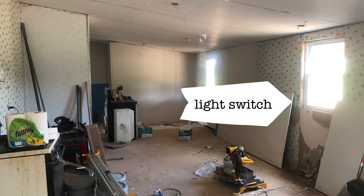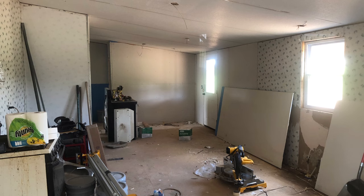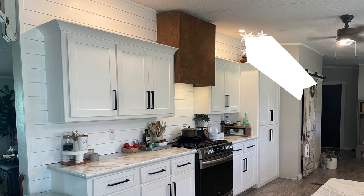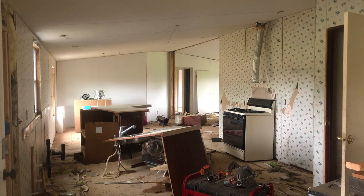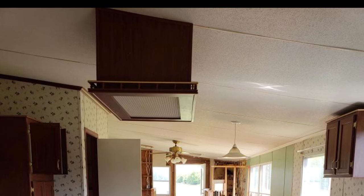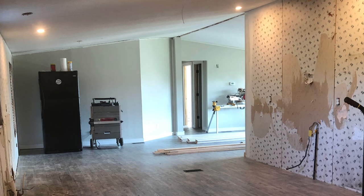We worked with the electrical that was in place. You can see the light switch for all the lighting currently in the kitchen — not the most ideal spot. We cut in four-inch round puck light holes about 16 inches from all the wall perimeters, because about 12 inches is your upper cabinet depth and you want the light to fall between you and your cabinet. We pulled new lines to all the new pucks, going from just two lights to eight, including the mudroom area.